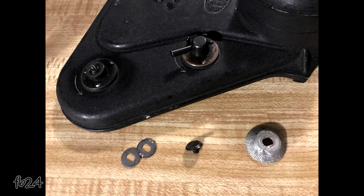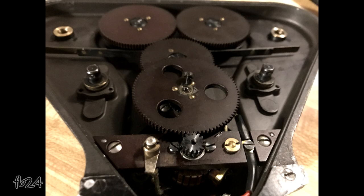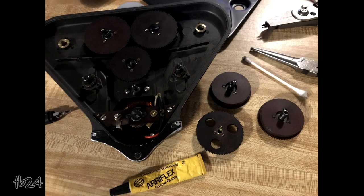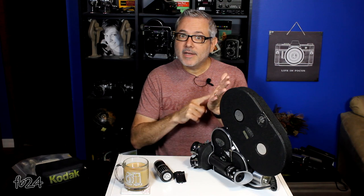The torque motor didn't work very well, so I took it completely apart and did as much of a refurb as I could. That included oiling the shafts — the drive shafts and gears. You don't want to oil the gears themselves, just the two little shafts and the drive shaft once you get it opened up. I completely cleaned everything in there. There's one little grease spot where you grease the main tiny drive gear. I cleaned it with rubbing alcohol, cleaned the brushes inside the motor, cleaned the coils, and cleaned everything I could with vinegar, rubbing alcohol, and soap and water. Be very careful — you want it only damp, not wet. Then I put it back together.